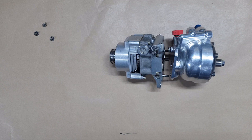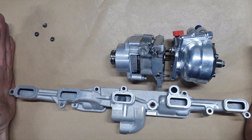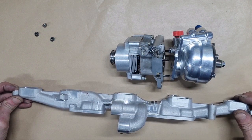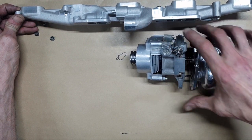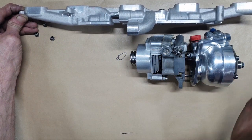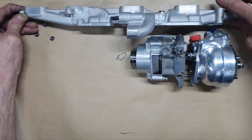Just to show you where the pump sits on the car — here's a scavenge manifold off a Cosworth TJV10, which would sit along the bottom of the sump. It would be mounted low in the car because it's high mass, for lower centre of gravity. So the pump would sit roughly here, the alternator here, and the timing chest out here — all driven through the alternator and into this pump. It's quite a big part — about half the length of the scavenge manifold.